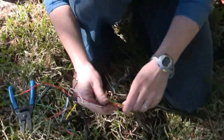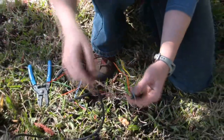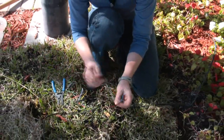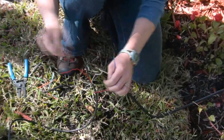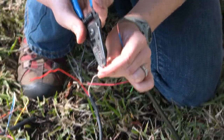Many of the irrigation wires you can get at your local hardware store — it comes with lots of wires, but you really just need three: red, white, and black. These wires don't come with black, so I'm using blue. You're just matching red to red, white to white, and normally black to black. Once I have the wire connected, I'm going to put a wire nut to cover that connection.